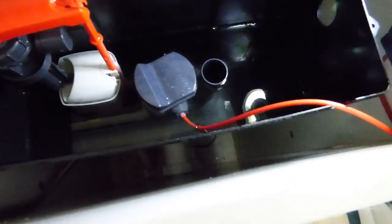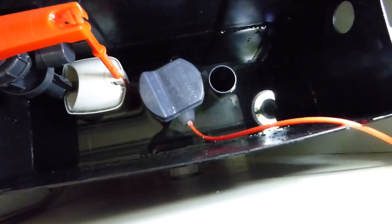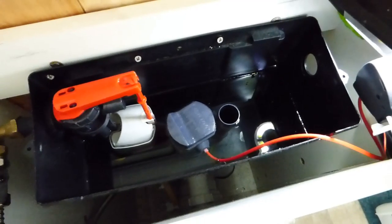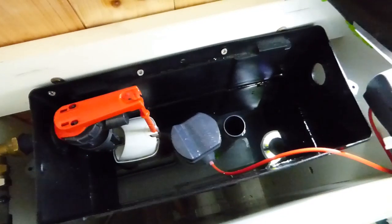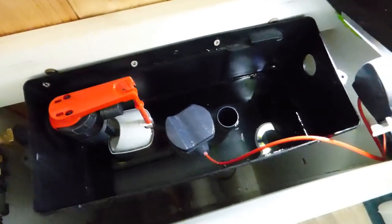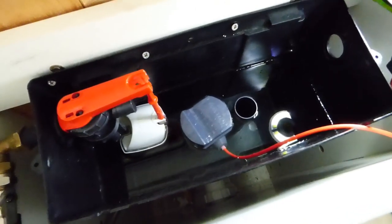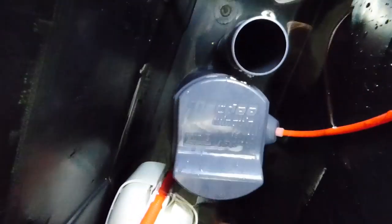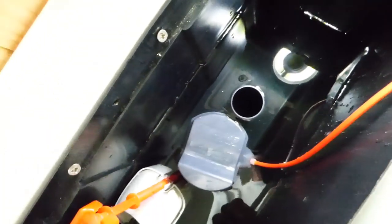And we've got to see if we can get the siphon out of here - it's not too bad. There's a little hidden clip down the back of it there. I can only really show you once I've got it out, and I can show you exactly where it is then. Other little problems you can get with these siphons is they can still run in slowly, but sometimes due to swarf or a bad washer inside the siphon. This is a McD, which does split. There's a little pin - it's down this side at the front.